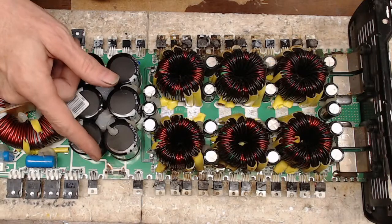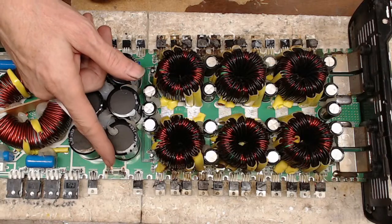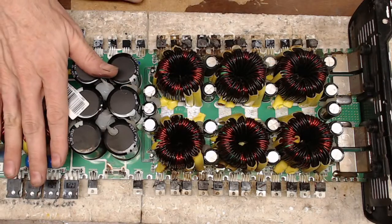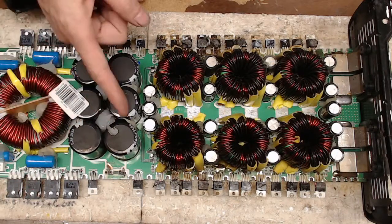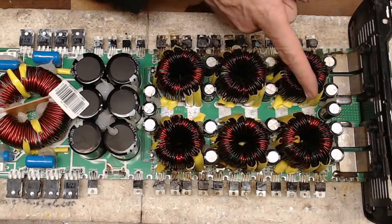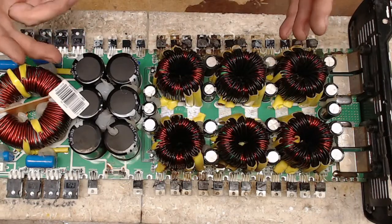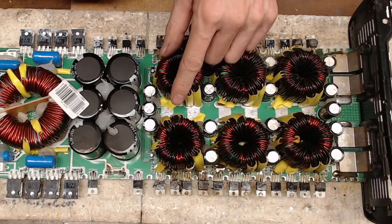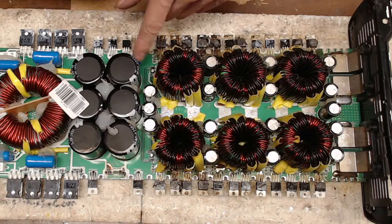Yeah, I don't see this very often at all, where the rectifiers were literally blown off the board. The output section is fine. There's no shorts in the output section. Power supply section, however, is completely, I don't want to say destroyed. Nothing's really destroyed. But both drive ICs have a hole in them, which really concerns me for the MCU.